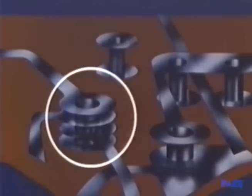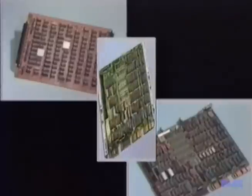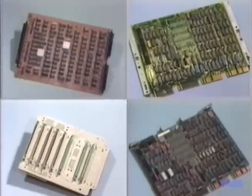The need to get more and more circuitry in a smaller space has led to the development of multilayer boards. Multilayer boards are similar to double-sided boards, but have one or more layers of additional circuitry sandwiched inside. Plated through-hole multilayer boards are the most widely accepted medium for interconnections in use today. These assemblies can be constructed from a number of different materials using a variety of methods.